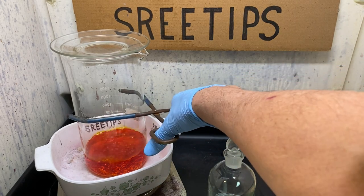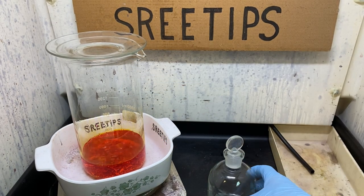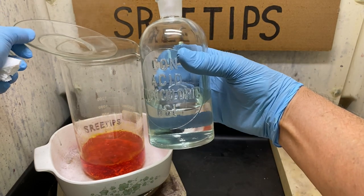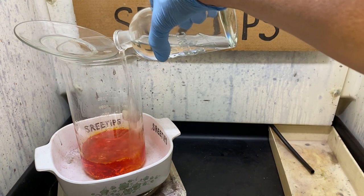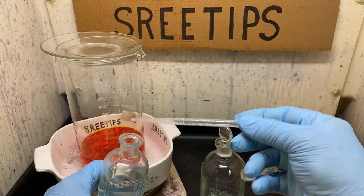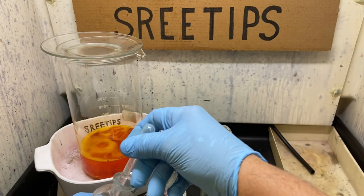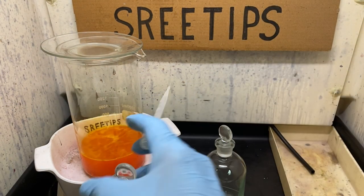We've been on about a half hour now and we've got some of the gold to go into solution. I added about 15 more milliliters of nitric acid off camera, so there's a total of 30 in there. I'm adding some hydrochloric acid here just to make sure we stay hydrated and we don't stall. Now I'm going to add another couple of squirts of nitric acid — we get an immediate reaction because that metal is hot in there, plus I just added fresh hydrochloric acid.